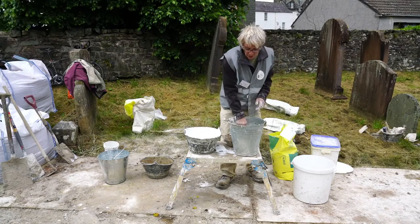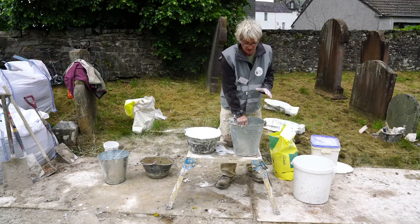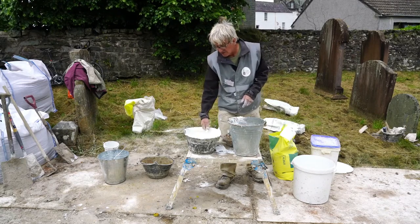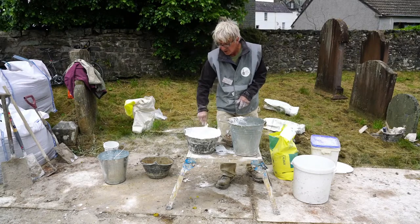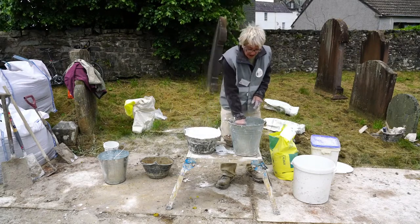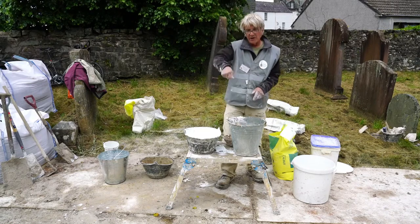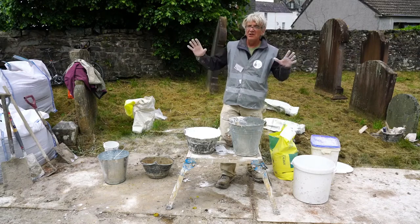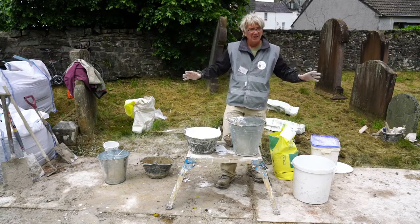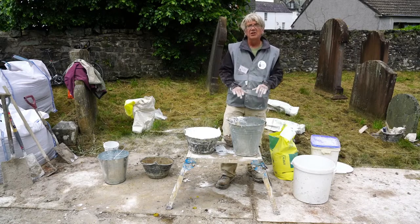But what they would do with lump lime depends on the finish you're after. You can see that's going to give a silky finish. There's no aggregate in there whatsoever, it's pure lime. This one, if there's any lumps left, they'll be small, and when you apply the finish, you'll get little bits of grit. Well, actually, I quite like that, depending on the status of the building.